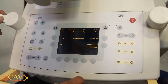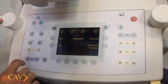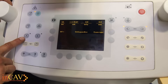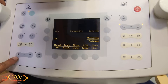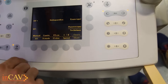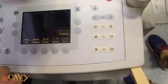The first thing you're going to notice on your screen is this screen blinking. It's because the frames per second is slower here than what the camera is, so that's what it is — it's not broken, there's nothing wrong with this unit. From here you can transfer the image to the screen if necessary by hitting this button, and you can print from here as well. This button is going to basically flip your image. This is your rotation, this is your brightness. Most of the time you're going to be on auto. Over here you can adjust to manual, which is going to allow you to actually input your own KV and MA for the procedure that you're performing by simply pressing the buttons on the left. But most of the time you'll probably stay on auto.